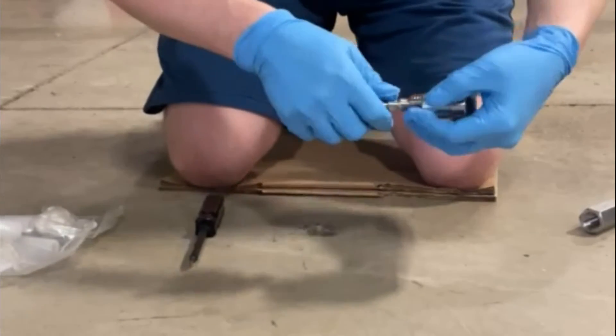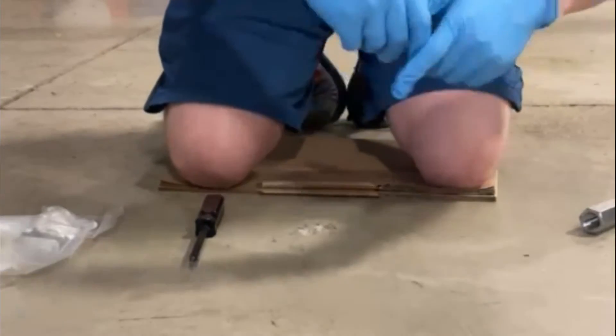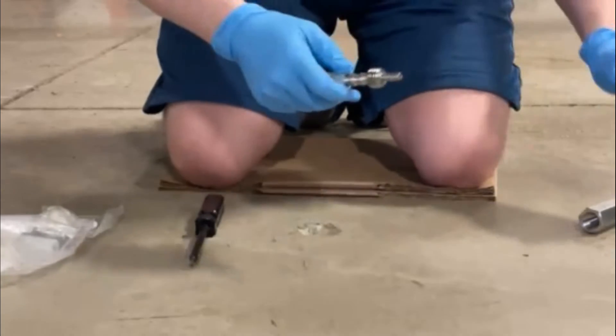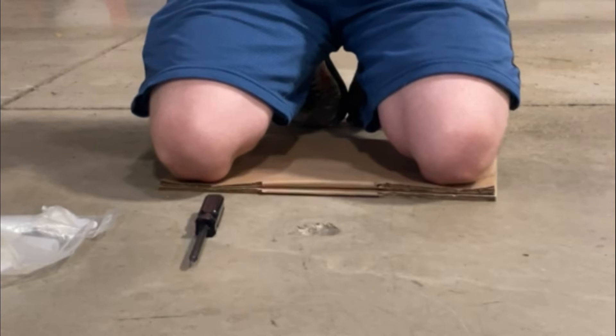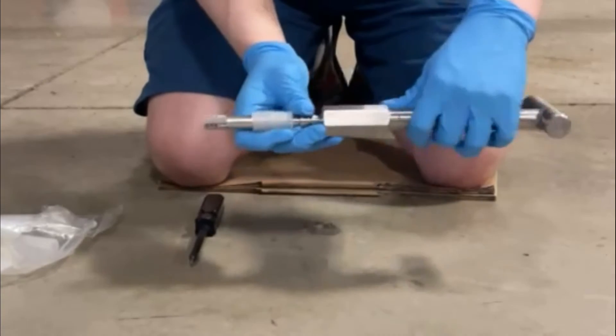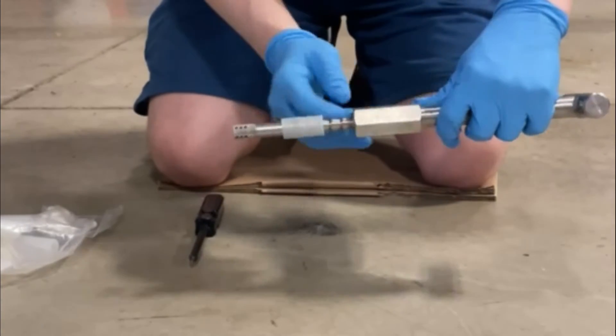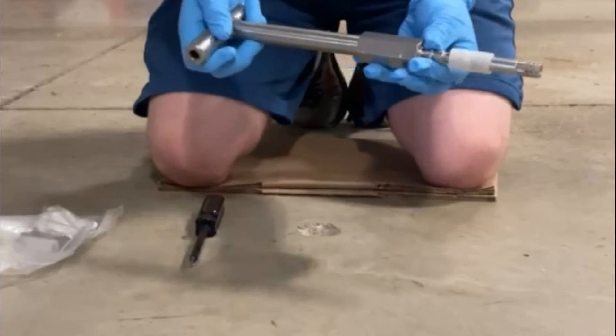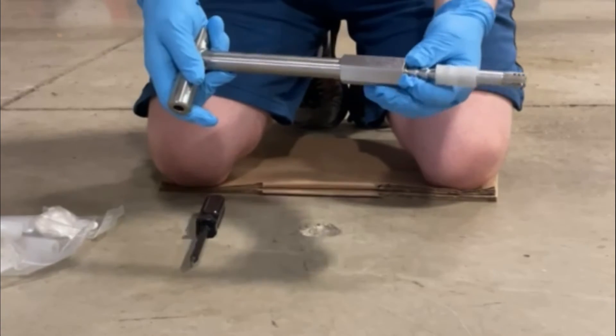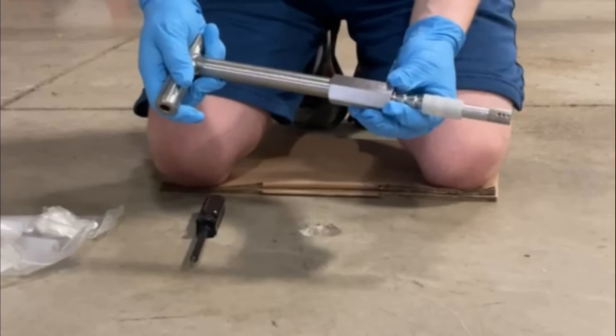Thread the assembled VaporPen device and capsule into the coupling of the IE tool. When threading the assembly into the coupling of the IE tool, you'll want to make sure that the bottom of the threads of the VaporPen are flush with the bottom of the coupling. This will ensure that when you're applying your bodyweight during the installation, you'll feel the coupling of the IE tool hit the concrete, affirming that the assembly is fully inserted.